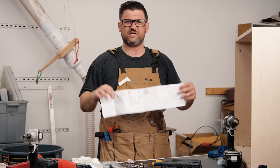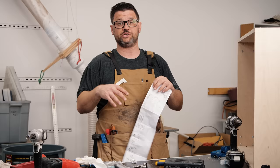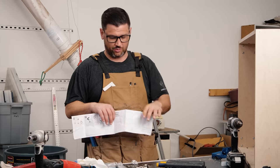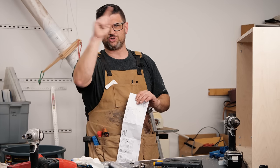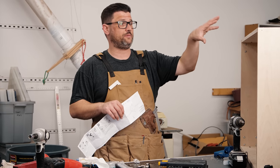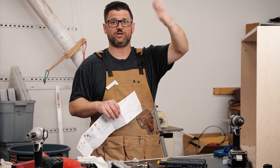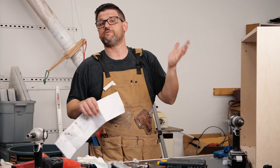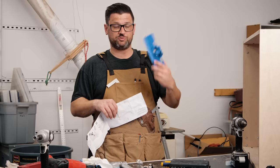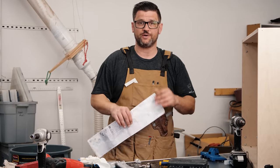Anytime you have any kind of cabinet hardware, it comes with paperwork that has all your dimensions — how deep you drill and all that — and it's going to be a little different for each set of hardware. These are full overlay, which means there's going to be an eighth-inch reveal around the whole cabinet. I'm going to put my cabinet door in and then trim the eighth-inch reveal off two of the sides, making sure it's in there when I install the hardware and then trimming the other sides when done. I'm using a Kreg jig, which makes it really easy; if not, your hardware will always have a template that comes with it.